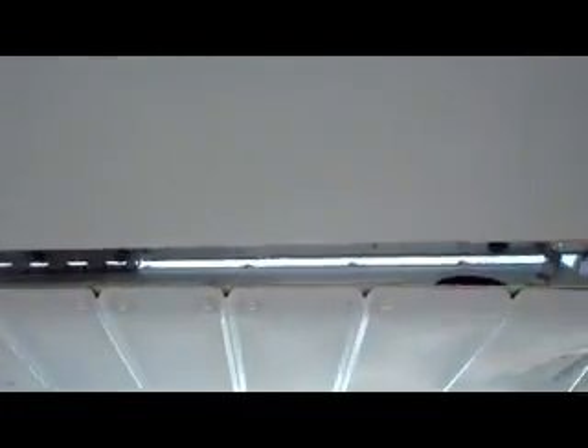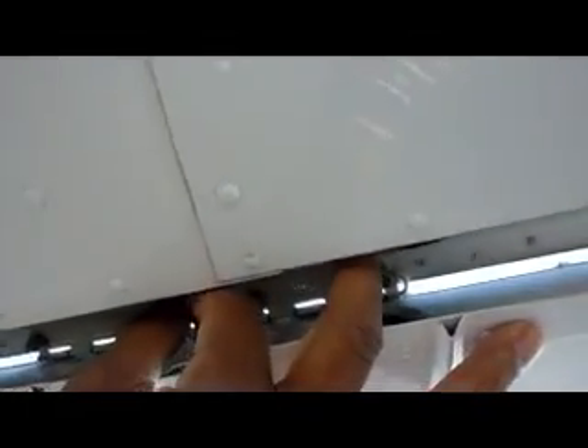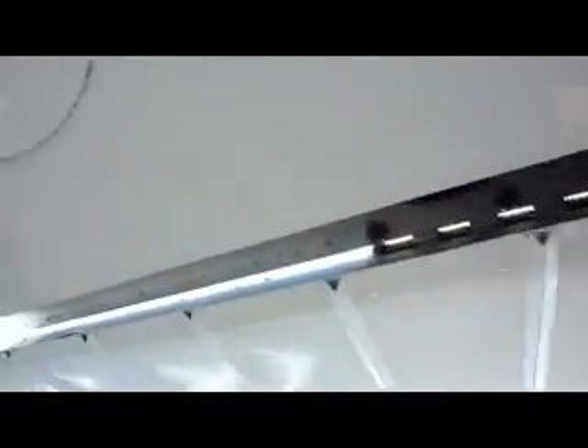We'll take the rope off last. Looking at the wing edge, which is fine. Shaking the wing to make sure there are no noises or rattles. These are the ailerons — make sure there are weights in the ailerons. Check the ailerons and make sure these hinges are in good shape and moving freely.